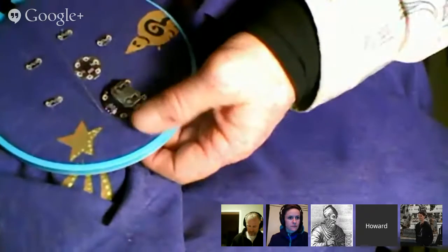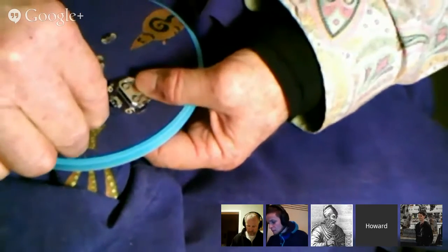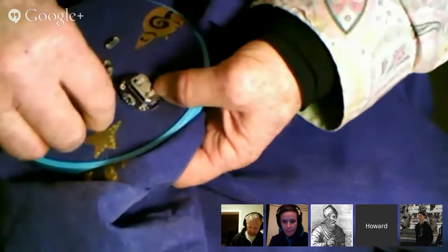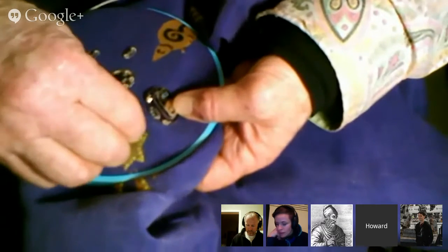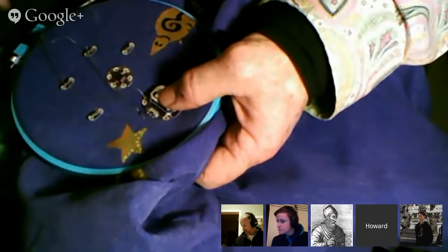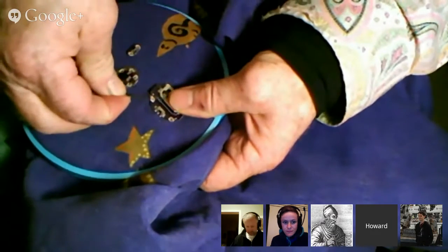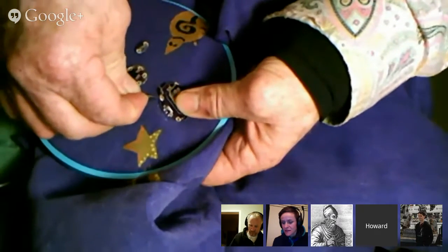Yeah. With your two AA batteries, you're going to get 3 volts across it, which I think is less than what you're getting on your lithium cell. However, what the batteries will give you is a higher current draw. Now, lithium cells are self-current limiting, that's why you don't need ballast resistors for them. So it may be that the battery will just allow the LED to draw more current, and you'll see it better. So the answer is, I don't know, but you might be able to get it brighter using the alkaline battery instead of the lithium battery, even at the same voltage.